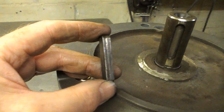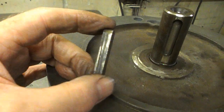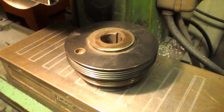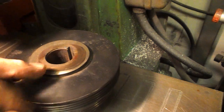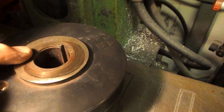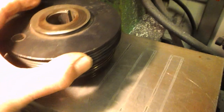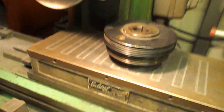And because it's been moving around it has made the fit even worse — it is so sloppy, to the extent that what we're going to have to do is make a kind of a stepped key. The fit in the pulley is not too terrible. But the shaft on the motor and the part of the key that goes into the keyway in the motor shaft is just rubbish. Also, this pulley has been rubbing on the case of the motor, so we're just going to skim this — take about 10 thou off it — and the easiest way of holding this is on a magnetic chuck on a surface grinder.